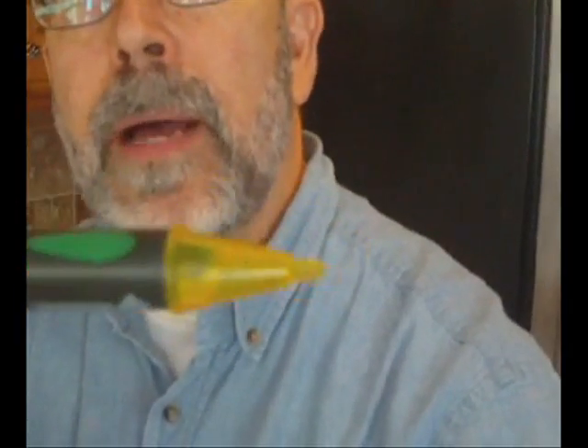The second thing you want to do is use a tester on the circuit itself. I've got my little tester — I'll call it my sniffer — and you use this right here to test anything that's electrical. I'm going to prove that this works, and I always prove it to myself before I go any further messing with any electrical work at all.